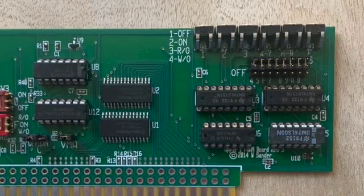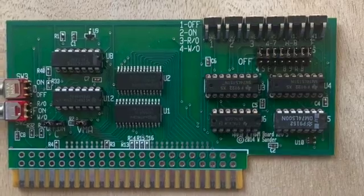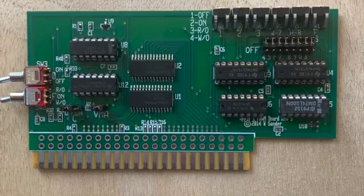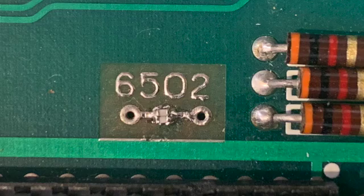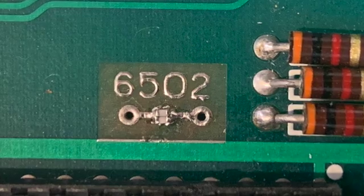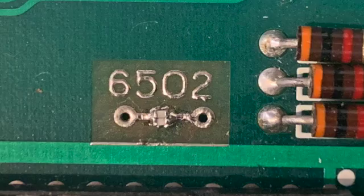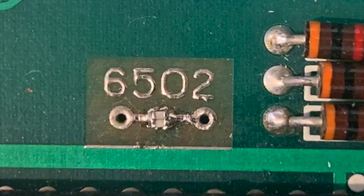The Apple One FRAM board can provide memory expansion and replacement for the onboard DRAM and ROM with non-volatile ferroelectric memory that retains its contents when powered down. To get the most out of the board, the Apple One VMA line, which is jumpered to 5 volts, should be re-enabled by replacing the jumper with a shunt, to allow the onboard DRAM and ROM to be disabled by the FRAM board on a cycle-by-cycle basis.